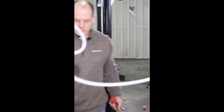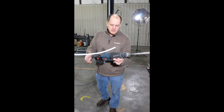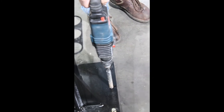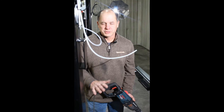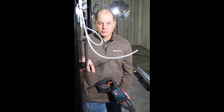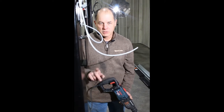After squaring, you'll want to drill. Use a three-quarter inch hammer drill bit — you can rent a hammer drill at Home Depot. Go into the holes in the base and pull the trigger. Don't push down on the drill; just keep it straight and let the drill do the work. It's critical that you drill all the way through the concrete — check for electrical lines first. If you don't go all the way through and the anchor spins, you'll have to move the lift. If you drill all the way through, you can drive a bad anchor into the soil and put a new one on top.